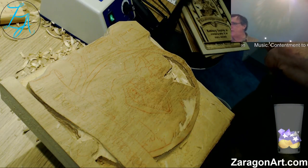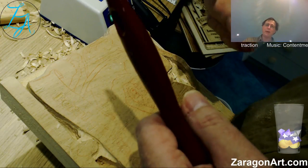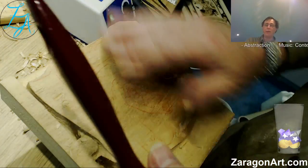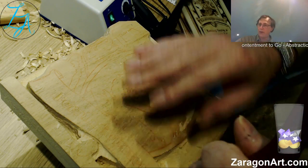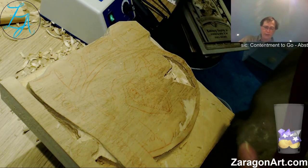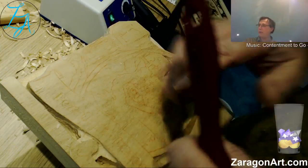Yeah, well, it doesn't take much, of course. If you've got some wood, and if you can get a plane, or if you've got general woodworking tools like a plane or sander, you can smooth the surface off really well. By the way, if you do pyrography on a wood surface, a good idea is to take some fine sandpaper and sand it down first, which knocks a lot of the surface fibre off, and you'll get a more consistent colouring when you do it.